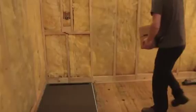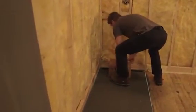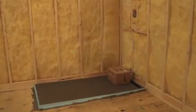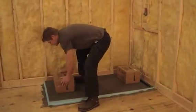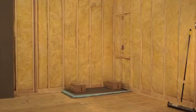Push the Rialito sealing gasket fully into the trap so that the base is evenly laying on the floor and the thinset mortar fully compresses in all areas underneath the base. When doing this step, take care not to crack the drain trap or it will leak. It's important that the trap is exactly in position for the sealing gasket to drop into position as well. This is a tight fit and no tolerance is available.